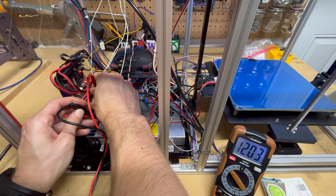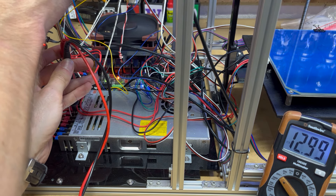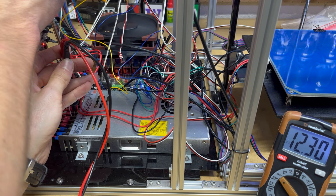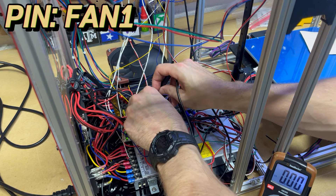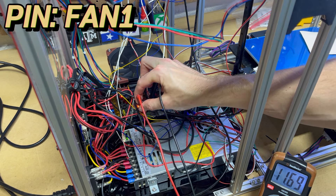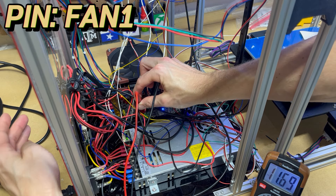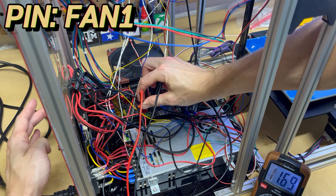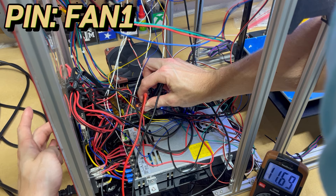Why is it doing this? The voltage to the board should be independent of the voltage that goes to the stepper motors and to the bed heater, so those components should be independent of each other. I checked the power supply to the board and it's showing 12 volts in. I was more inclined to believe the flickering lights were related to the board itself. The fan 1 slot shows 11.69 volts when there is no heater on — but watch as I turn the print bed heater on: the fan 1 voltage drops to 10.91 volts. Thus, we get flickering lights.